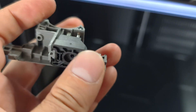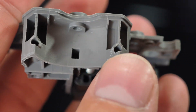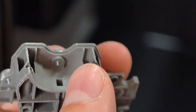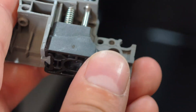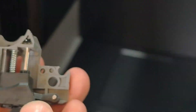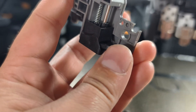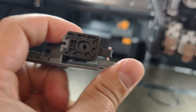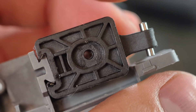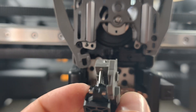This is the back side of that assembly. You have this spring-loaded guide for the left extruder — the filament comes in there, gets fed through this silver tube, and then the extruder is in there. When it's retracted, it slides up with the extruder and comes out of the way. The reason it's a bit difficult to get off is because this thing here is actually the filament cutter — it comes across and cuts the filament in the tube.